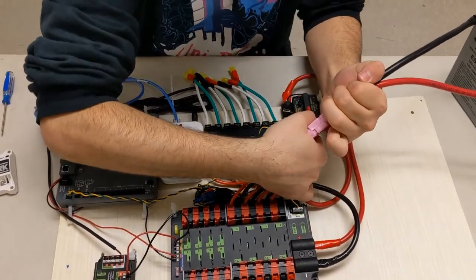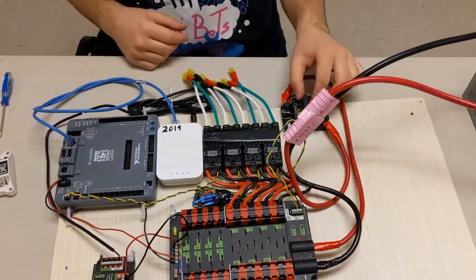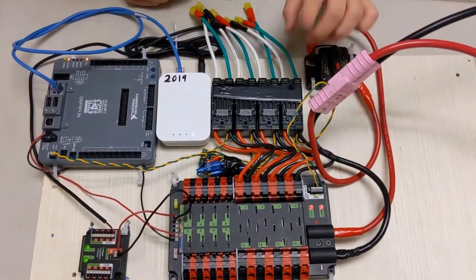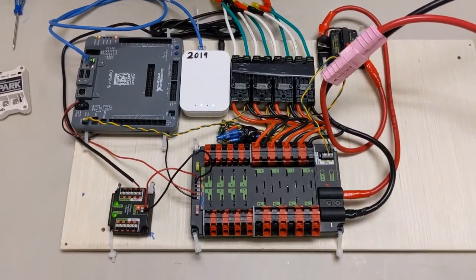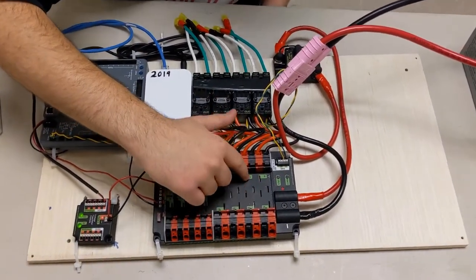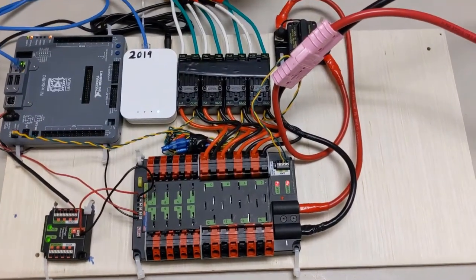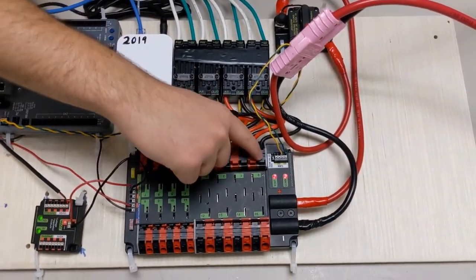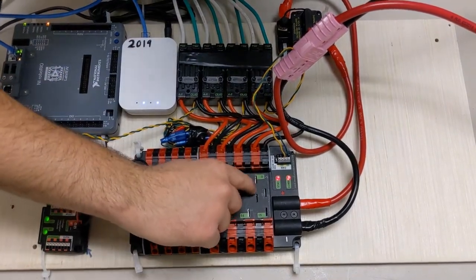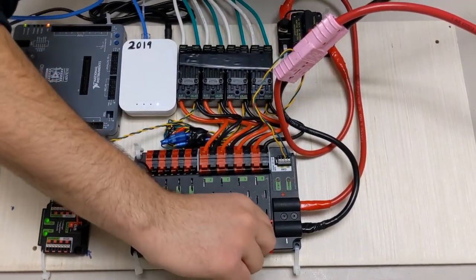and we should see the motor controllers light up. So connect the battery, close the circuit breaker, and our motor controller should light up soon. But no, they did not light up because we forgot one thing, and that is the fuses. As I said earlier, you need fuses for these things to complete the circuit. So right now it's an open circuit, and these two belong to this fuse. As you can see, like right here, this fuse comes to this one, this fuse would go to these two.